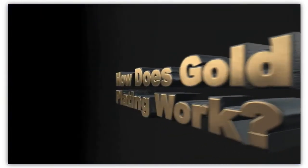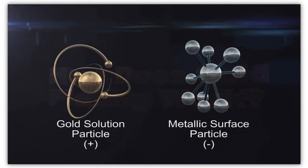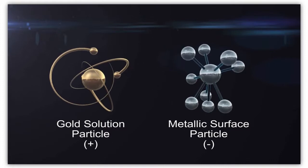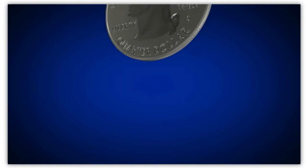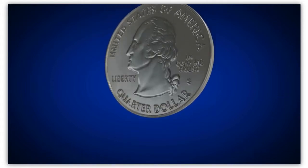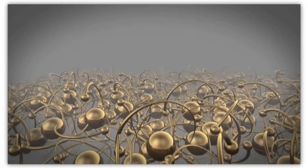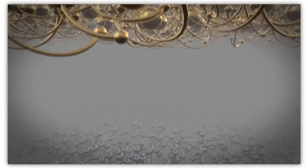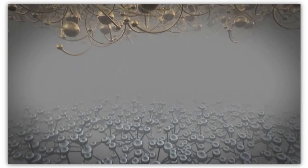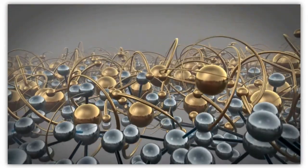The process of gold plating is very complex, but can be explained very simply. The ions in our gold solution have a positive charge, whereas the metallic surface is given a negative charge. Once the object being plated is exposed to the solution, the ions begin interacting. The positively charged ions from the solution are attracted to the negatively charged surface of the object. They will therefore bond to the surface, creating a fine, beautiful layer of pure gold on the surface of your object.